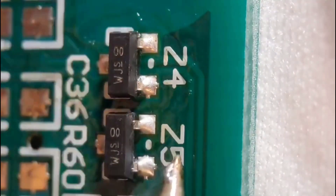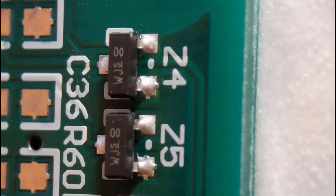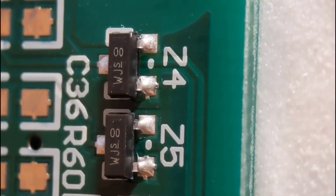I'm using lead-free solder, which is why the joints are a little bit duller than normal. If they're really shiny joints, it tends to be where people are using leaded solder. I'll give it a quick clean and you'll see the amount I've got on there. If you can get all these nice and uniform, not too much solder, it will really help in the future. As you can see, I've got a nice amount on the front four pads, same at the back — that's basically how I fit my SOT-23s.